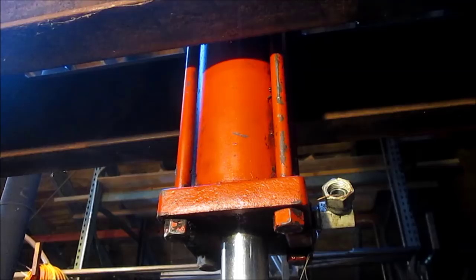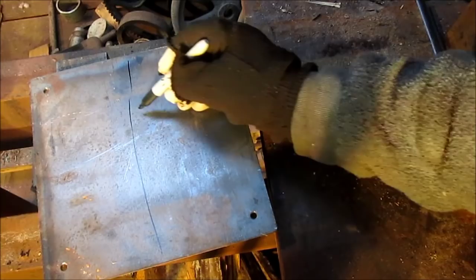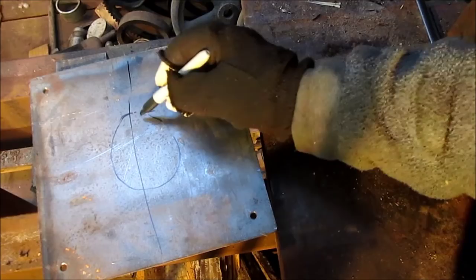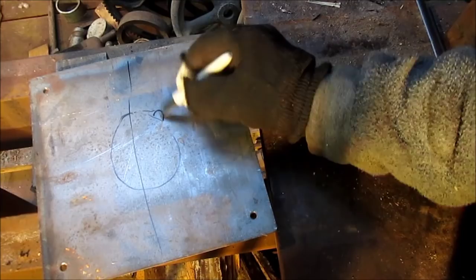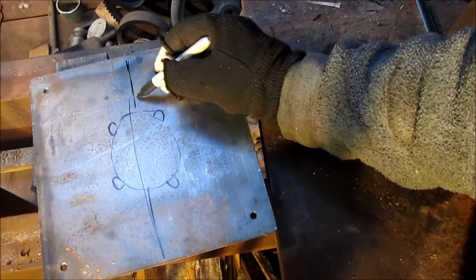All right, this is the way I see it. We're going to come in halfway and cut that piece of steel in half. And then, in fact, before we cut it in half, we're going to do a hole, either bore out the hole or something, that's the exact size of the ram, and then cut out the notches for the bolts, and then come in and cut it in half and probably figure out some way of clamping these two halves together, and then bolting that.